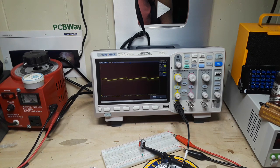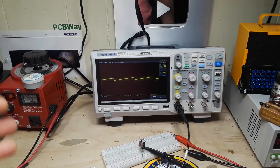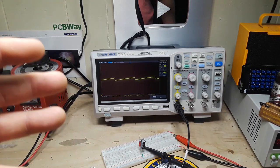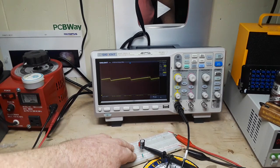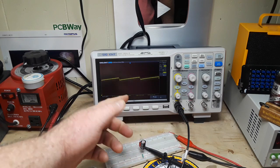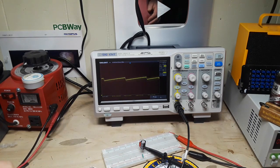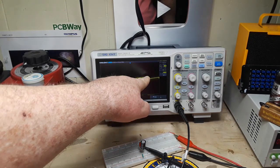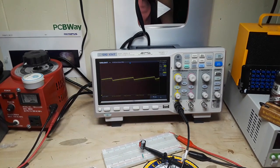It's kind of like, I always get these two confused, centripetal and centrifugal force. The one that throws you out from the center, it's a pseudo force. It doesn't really exist. The negative resistance doesn't really exist. But we're entering a pseudo region of negative resistance on here. And then we're simply using the capacitor to charge and discharge. I mean, that's what you're seeing right there. Charge, discharge, charge, discharge.